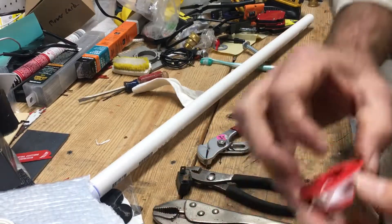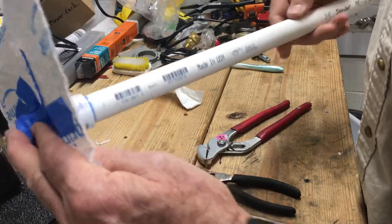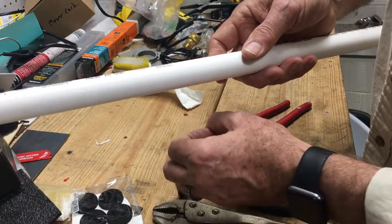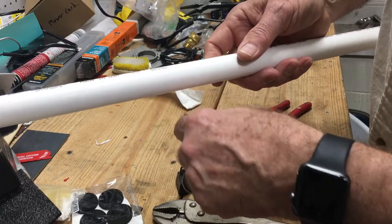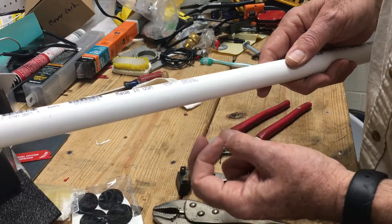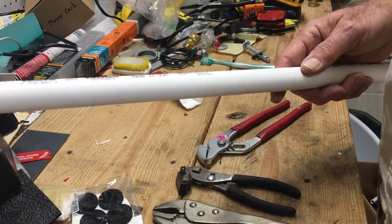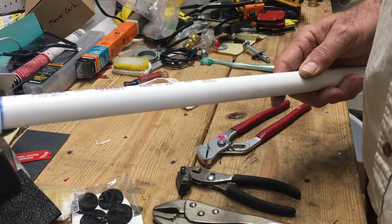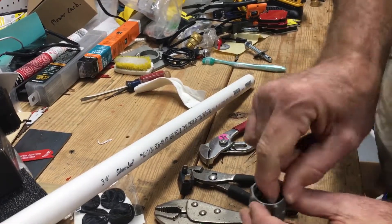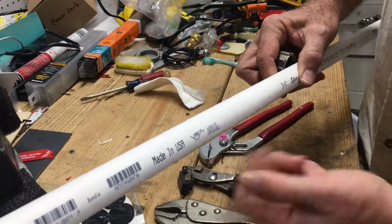There's your custom-made shower head installation video. One more thing: on the other side where the pipe goes diagonal and then down, the piece from the shower head that fits on there — if it's like a hose connection where you have a rubber o-ring or rubber washer inside the fitting that screws in, then you don't need Teflon tape on that part. If it does not have a washer, then you do need pipe tape. However, the one you've already got on there — I can almost guarantee it has the kind of washer I'm talking about. Like this rubber washer right here means you don't need Teflon tape on this part down here.